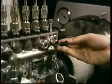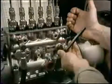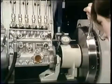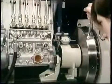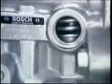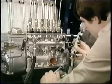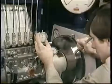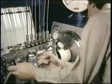Plug the overflow using a fitting like this. After you remove this plug at number one element, rotate the pump until number one is at bottom dead center. BDC looks like this. The upper edge of the roller tappet will lift the finger of this lift-to-port-closure gauge. So when you've preloaded and zeroed this gauge and locked your rack at full load, you've completed your setup to measure port closure.